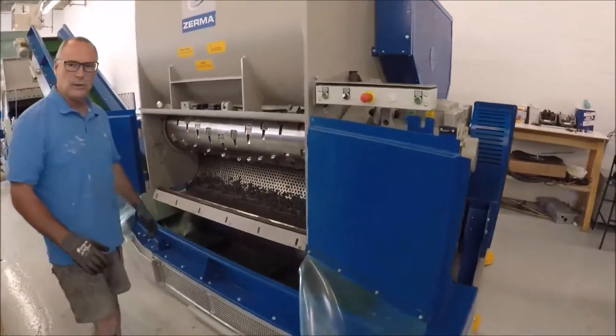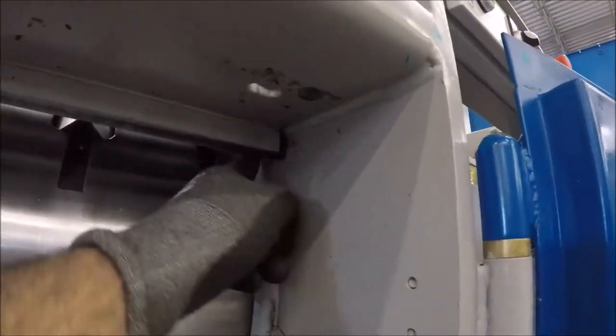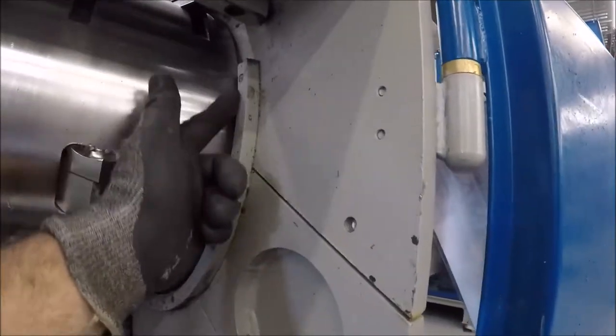The main hang-up points for material are going to be right in these areas here. What you need to do is take a wire brush to them — brush these out, clean all this off. Have a nice strong vacuum and vacuum out all these areas. There's also the ability to get material caught here. Once the screen's out, take off all the material that hangs up in the back. You're going to get all this material out of these angles and your hang-ups here. Let it drop down and vacuum out. Then use a strong vacuum and a sweeper brush along here to clean off any material on your back screen support.